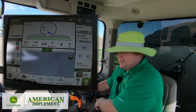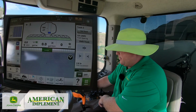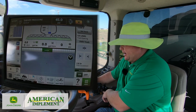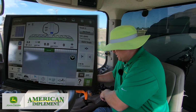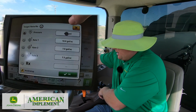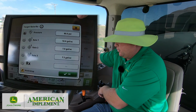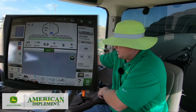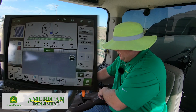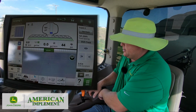I told you that we want as much volume as we can to create dilution. So when I do this, I go to manual pressure, okay? And I spray just at a manual pressure. So what I'm going to do is I'm going to touch this and where I'm at, I'm not too worried about any driftable fines, so I'm going to go to 80 psi, and I'm going to do a full system flush, okay? So I'm going to turn my pump on, okay? I'll throttle up just a little bit so I make sure I get enough pressure, okay?